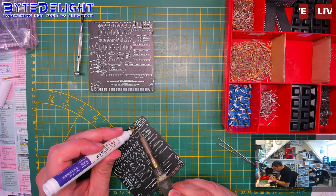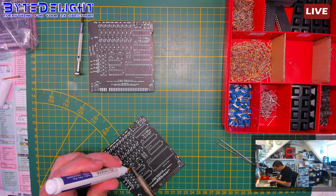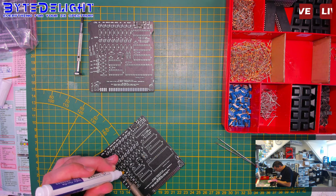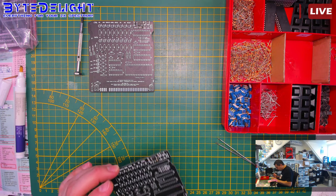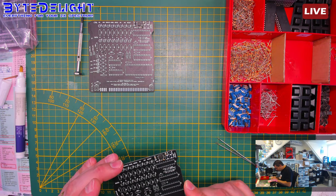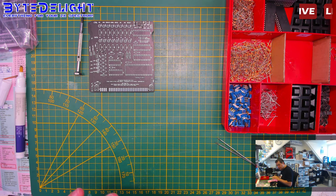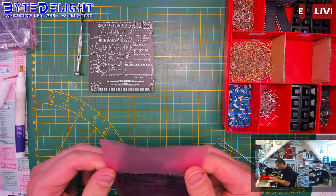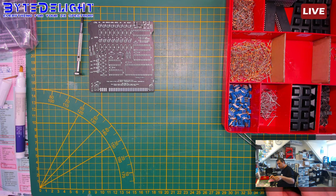And the reason I'm using this one is that I need the LED strips with a separate clock input, because the spectrum isn't fast enough to supply the signal in 800 kilohertz, which the cheapest addressable RGB strips use. So I'm using the one with the separate clock input, and I have two types of those. The WS2801, and I have the CX2801 or 2802, I think.